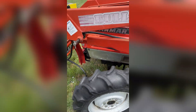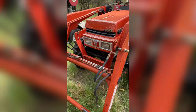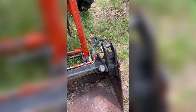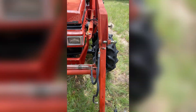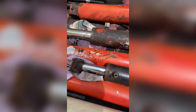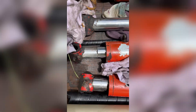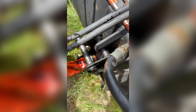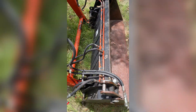All the cylinders are off the little Yanmar. The 4-in-1 tilt and main lift cylinders are all leaking, so they all need doing up and inspecting. Plus, once we come back, we're going to redo all the hosing on this machine - as you can see it's all bloody sun-perished.